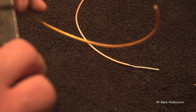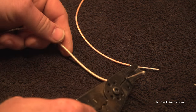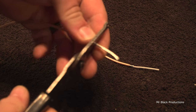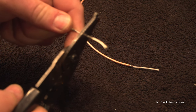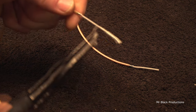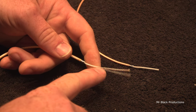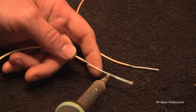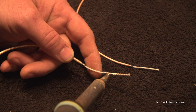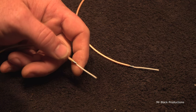We're gonna put it in the 12 and 14 hole on the dikes. It's a lot like this. We're gonna rock it back, rock it forward, up, down. It'll just slide off. Once again, if this gets pinched and it's pulling on the center conductor, just stop. Take your soldering iron, heat up the jacket, and this will slide right off with no pressure on the center conductor.